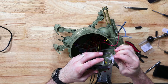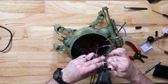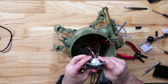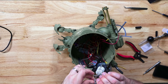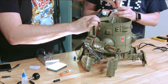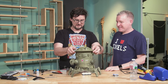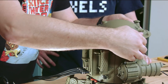Now we're doing the final hookup for the pump outlet going to the smokestacks. When hooking up the pump, make sure you have the inlet and outlet correct — just place your finger over them to feel which one is sucking and which is blowing. We're using a Y-connector on the outlet to go to each of the smoke stacks. On the Ghostbusters ghost trap, I designed a 3D-printed rail inside the lip of the top with a bunch of outlets, so we only needed one connector and the 3D-printed part handled the rest.